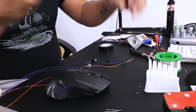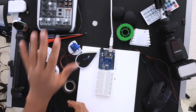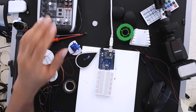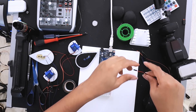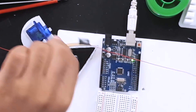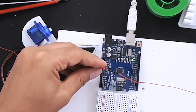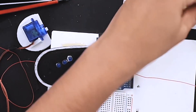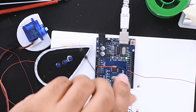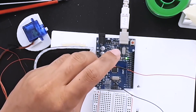I didn't show you all the connections I did, but basically there are three wires for the motors: there's ground, there's power, and then there's data. So I fused the wires for power and ground. The red pin is going to plug into five volts. We also have our common ground, which is the black wire, so we're going to plug it into a ground pin.